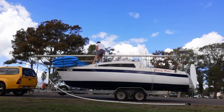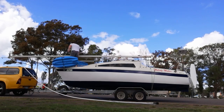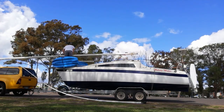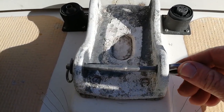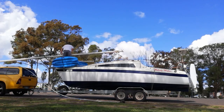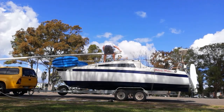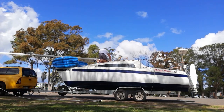Now, after untying the mast, I need to walk it forward. I do need to apply a little bit of pressure to the bottom of the mast because it is a little bit top heavy. It's not too difficult though. There is a bolt that I attach to the bottom of the mast, that attaches it to the boat, and then it basically just pivots on that one bolt until the mast is standing. There's no second bolt. There is a hole for a second bolt, but I think that's if you are going to raise the mast from the rear of the boat.